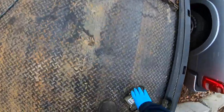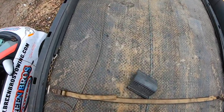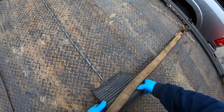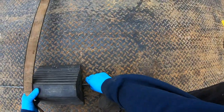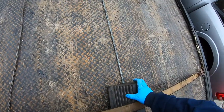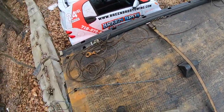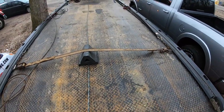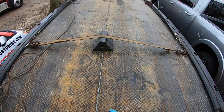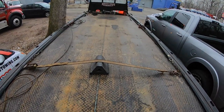Just keep an eye on the cable. This wheel chock actually has like a channel in it, so you can just do it like that. I don't normally use that — I just use my remote, or after the first three wraps I put a car onto it and do it that way. This wheel chock has a kind of channel underneath it so it'll keep it nice and tight but it won't crush the cable, and it'll spool up. Always make sure your cable is good and smooth and that it's not going to knot up on you.